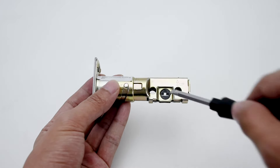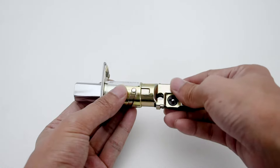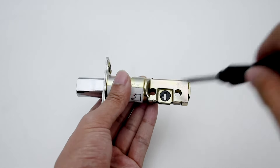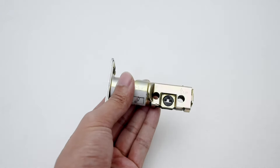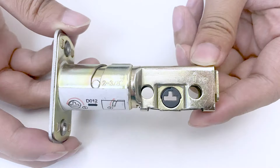If you want to use the previous length of the bolt, insert the screwdriver into the T-shaped hole and turn it left. The bolt will extend and you'll be able to twist it. Insert the screwdriver again and turn it right. The bolt will retract and you can install the bolt into the door, making sure the up icon faces up.